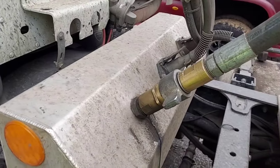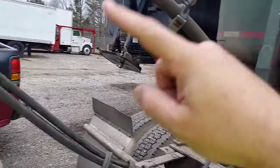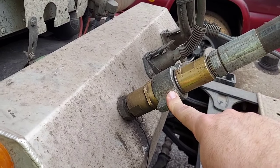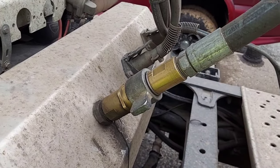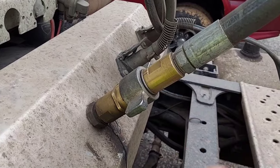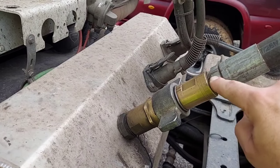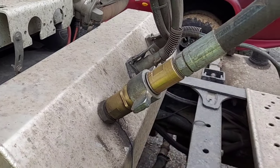One other thing to check is when your pump is coming on and your PTO is coming on but nothing's happening — check your connection of your main line. This is a single-line system. Some trucks use a dual-line system, which is a feed and a return. This does it all in one. But these connections, especially when you're swapping trailers and stuff, get trash inside and it'll feel like it's tight. Sometimes you've just got to force it a little more. I've had some where you had to tap the ears with a hammer to get them to tighten all the way down. But before you do any of the other pump checks, check your connection first to make sure you are screwed all the way in. Because this connection has to push in the other connection to actually open up the little valve in there for the fluid to flow. So check this first.